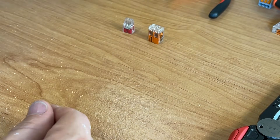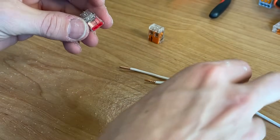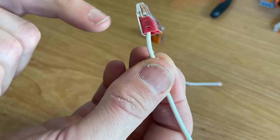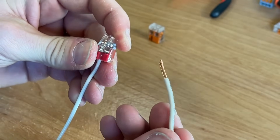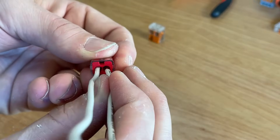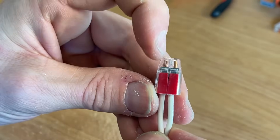This happens all the time and it's all about the installation. It can be a very effective connection, but there is a lot of opportunity for error. The big design difference that makes me more of a fan for the Ideal push-in is: take your solid core wire, strip to about a half inch, insert it, and you can see it's secure. Then take your braided strand, making sure the braids are not frayed, twist it slightly, and press that in. You can see the strand is seated.